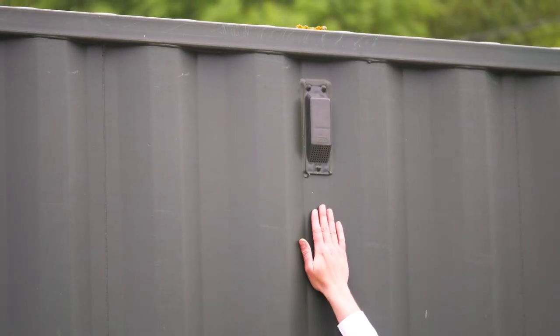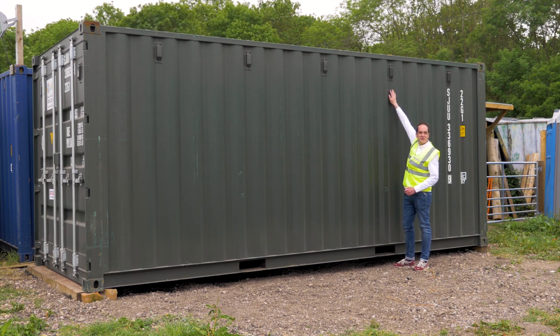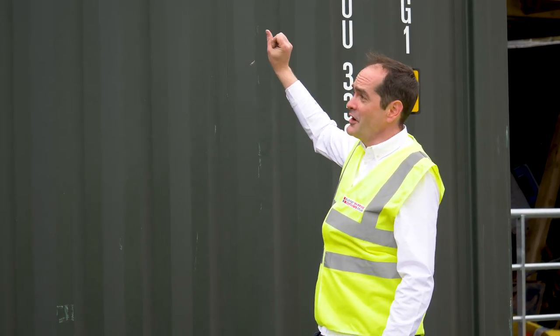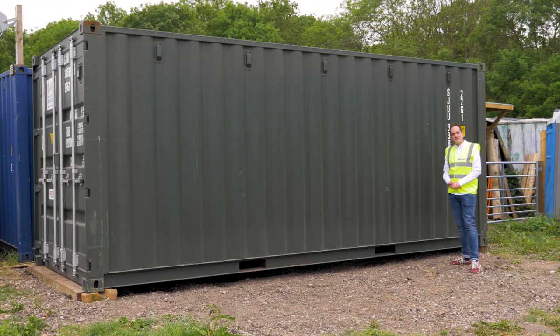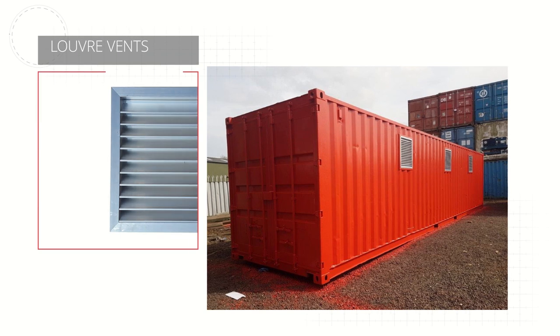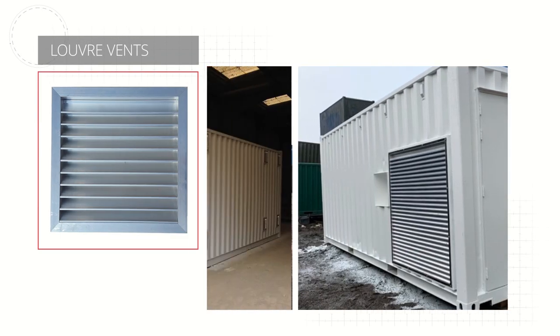Right at the top we've got a number of small cargo vents. These are about an inch square and covered with mesh to stop bugs getting in and out. On a basic configuration container there may only be two or four of these vents, however we're seeing ranges with up to 16 or even more vents coming in these days. Our top tip is that these vents are very small and covered with mesh, so they won't allow for a fantastic level of airflow. If you want airflow through your container we recommend having some additional louvre vents fitted, which we can fit at our depots or send out to you to fit on site.